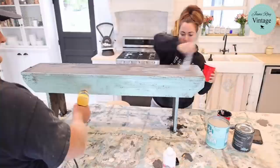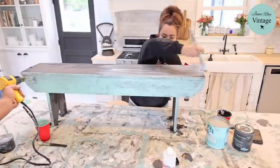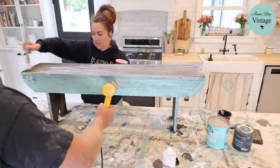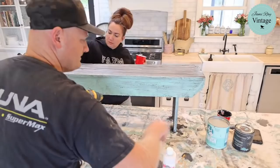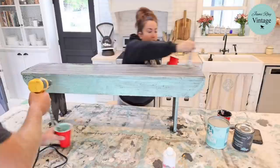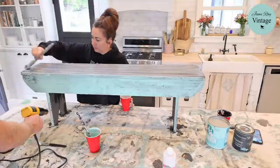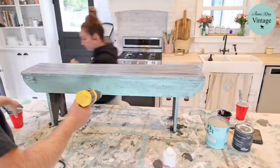You can see the milk paint — I've got it a little on the thin side so it's a bit drippy and runny, but we actually love that. If you wanted a smooth top coat finish on something you'd definitely want a flat brush or foam brush rather than a round brush. You can also mix the salt wash and milk paint directly together and mix it all up with a fork instead of mixing them independently.